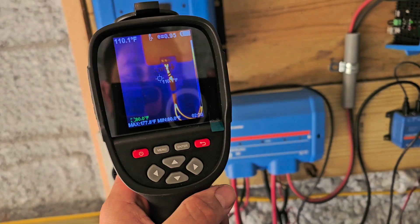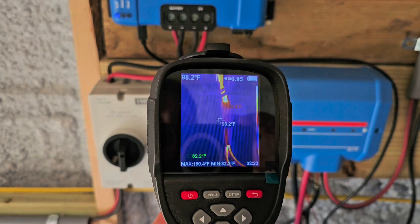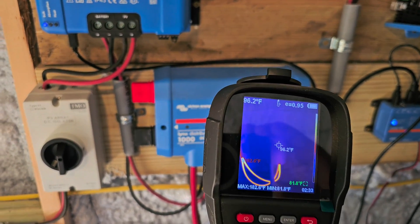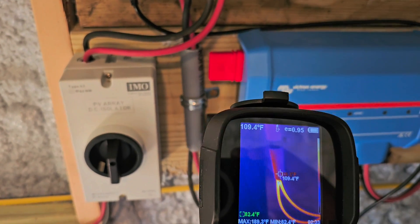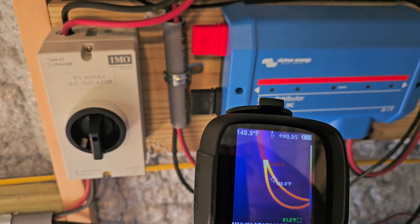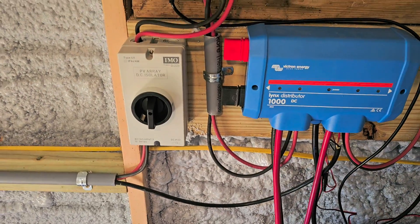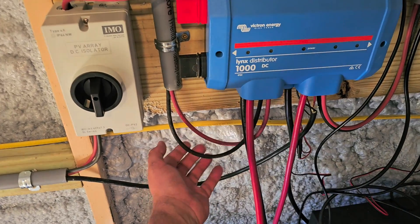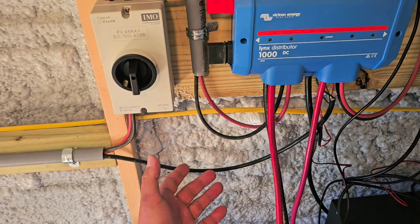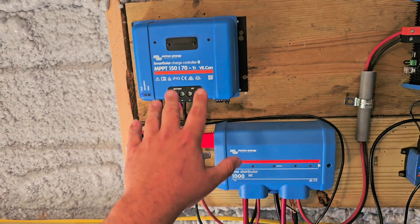Having a thermal imaging camera is a great tool to have — let me show you why. You see the charge controller is getting a little bit hot, 120 degrees. But look at the wires going to the actual distributor — those are the wires that come from the battery terminals. Look at how hot those wires are: 168 degrees. If I didn't have this and wasn't monitoring, I wouldn't be able to see that. And what does that indicate? That's dangerous. I could end up burning these wires in half — and to the touch, they're really hot. So I'm going to have to increase the cable size and make sure I monitor my voltage and current.